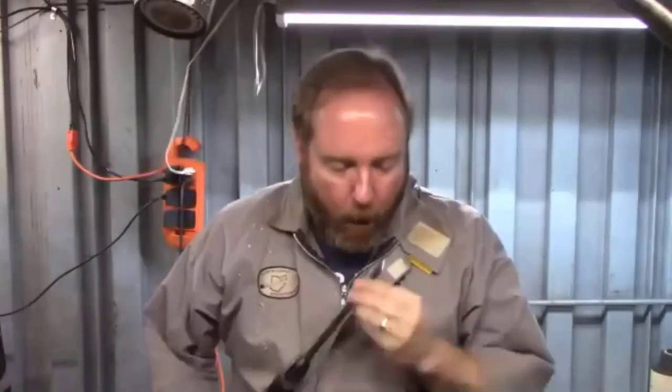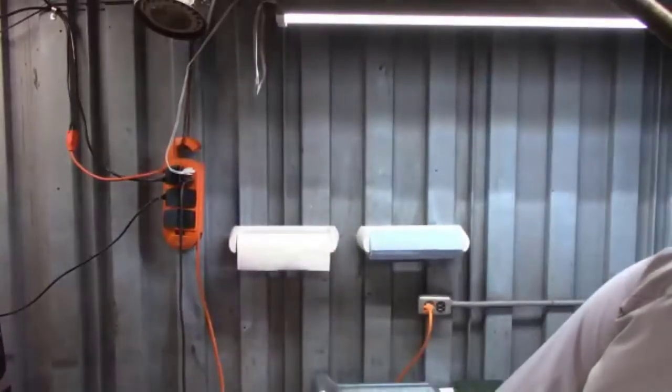I've got a question, Pete. When you are turning the foot, in a real life situation, you'd have tailstock support. Definitely. If I've got the whole piece in there, yes. So how much of a nub do you leave, or how much does the tailstock get in the way of what you're doing? So it does get in the way. So what I'll do at that point is I always end up leaving a little bit of a nub on the very end, but I'll turn it down as close to the little cup in the live center as I can. And I'll probably switch to my smaller bowl gouge so that I can get in there even just a little bit tighter.